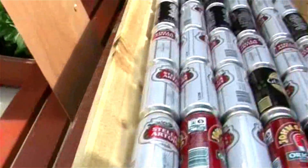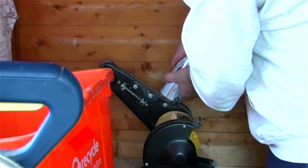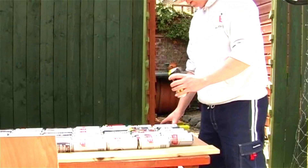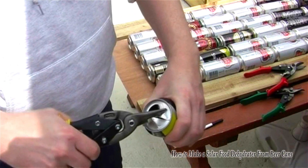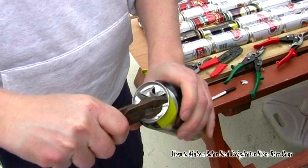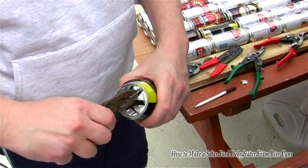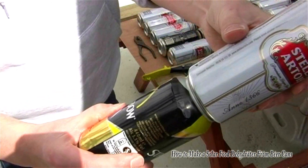Okay so I took a load of beer cans and chopped the bottoms off them. To do this I used a sanding machine and sanded the bottoms down until it broke through the metal, then just gave it a little tap and the bottoms fell out. Then I used tin snips for the tops to cut little slices into the top, and using pliers I bent those slices to make little fins. The idea is that as heat rises through the tins, the fins make the air swirl and turn around inside the cans, getting everything a little bit hotter by the time it reaches the top.